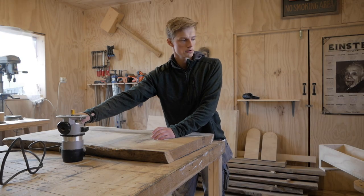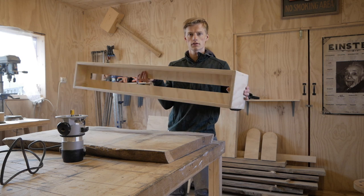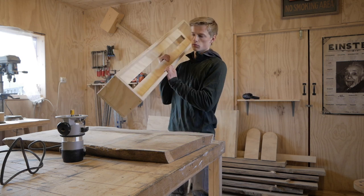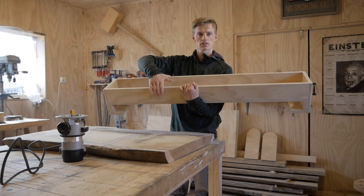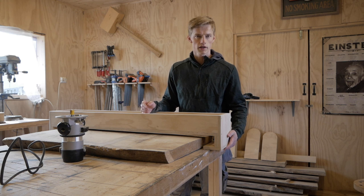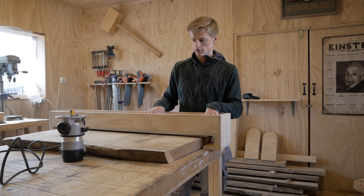You're also going to need some sort of jig. It's a very simple jig that looks something like this, with one bottom piece with a gap between for the router bit, then a couple of fences and then some legs. You could make these more complicated if you wanted to — you could have legs where you can adjust the height — but I found that having a simple jig like this works for most of my slabs at least.